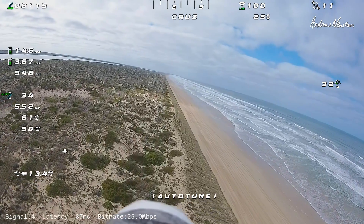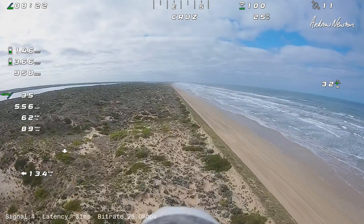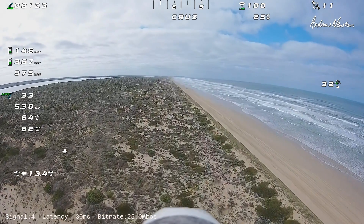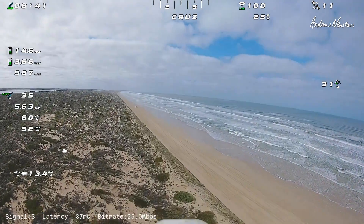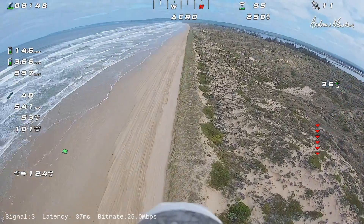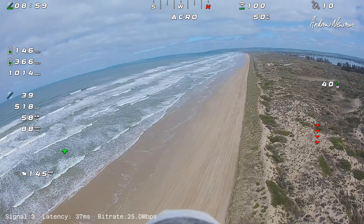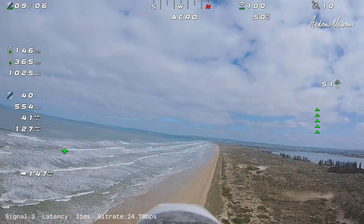I need cruise mode to see how I'm flying, and the final position tilts — I've got auto tune on there, maybe that's why it's confusing it a bit. So that is the one-axis follow. I prefer the three-axis follow with the gain turned right up so that it's not self-levelling — it just feels more natural to me. And I've got the camera tilted down a little bit just so I can see the nose. Cruising along, great stuff. You can select head tracker but you have to come in and land, change to head tracker, and cycle the power to the gimbal before it will take effect.